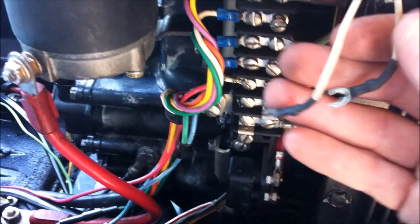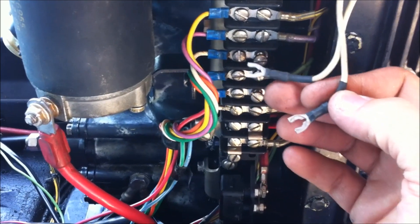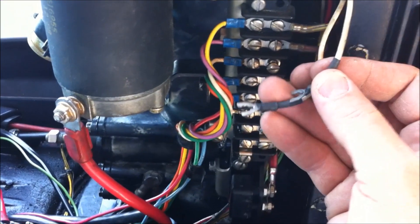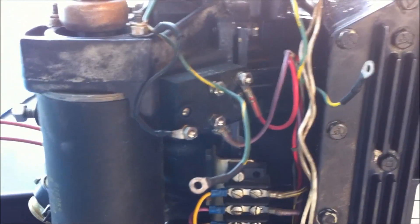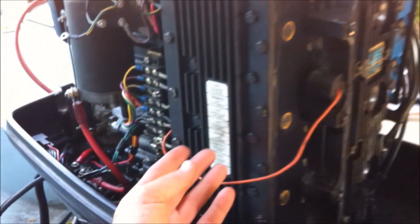I would have marked these with tape, maybe because they're both coming over from the sides, so it may not matter. But you do have a picture of both these white wires — the problem is they're both the same, so it would have been better to mark them before taking them off. They might end up on the same thing. I'll just have to look back on my photos. Anyhow, that's what I'm going to do next: find wires and reattach them to their pegs according to the pictures.